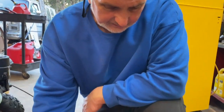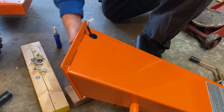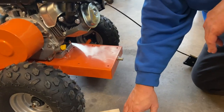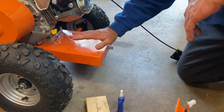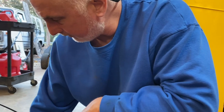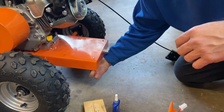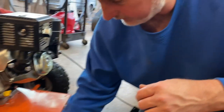Here's the upright piece — the first part of the frame. It has a flat flange at an angle with four holes to be bolted right here. We're going to use these nuts and bolts, and I'm going to put blue Loctite on all this stuff because this stump grinder is probably subject to a lot of vibration. I'm going to put one flat washer on and try to bring them all through here, get the nut started, then dab some Loctite on and zip them all down.